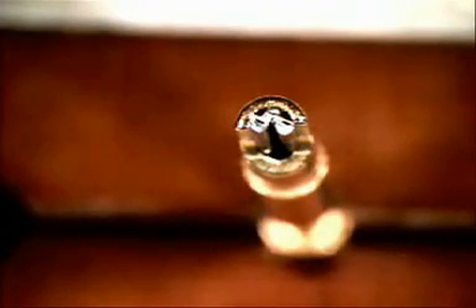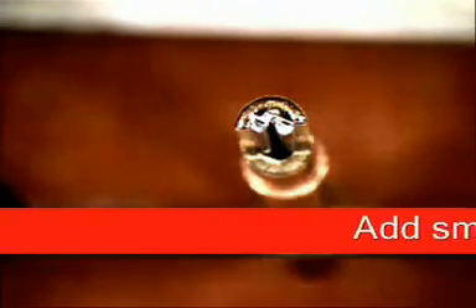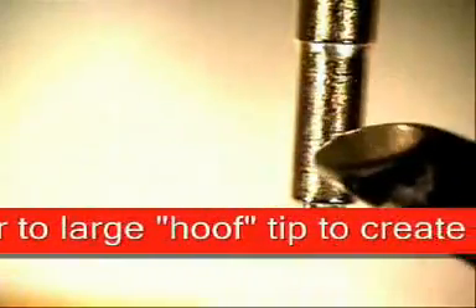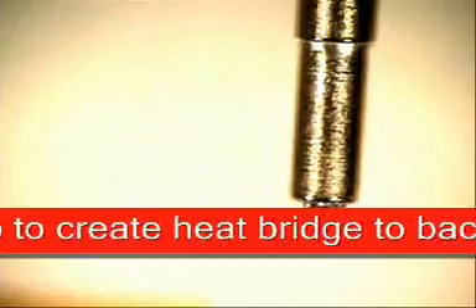Next, with a small amount of solder and a nice clean soldering tip, you're going to go to the back side of the gold cup — there's a little lip right here and the top of this. If you try to do it here in the center somewhere, that's your best bet. That way if you get too much solder it won't come out and flow across the top, and your connection right here to snap it into place for your rings will still work fine.